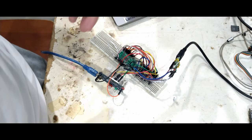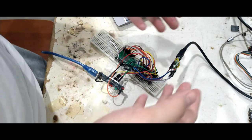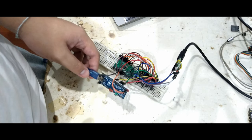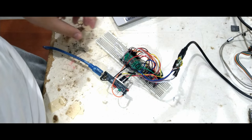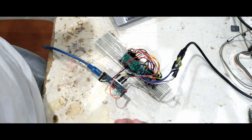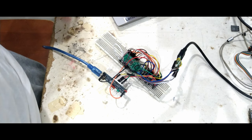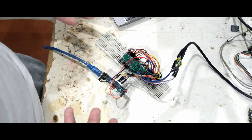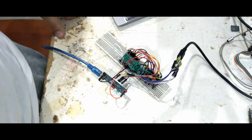So, I've made one too, but this one is a little bit different because it doesn't flash the SPI NOR flash, but instead pushes the bitstream, loading it directly to the FPGA. When I need to do something, I just hook up this STM32 Maple Mini dev board to the iCE40 board that has my FPGA, and pretty much that. No need to whack in the SPI NOR flash, and you just drag and drop forever. You don't need to flash the SPI flash, which is quite annoying. Flash it a couple of times, and it's going to wear out quickly.